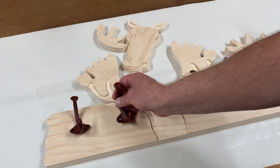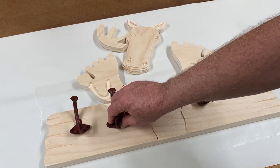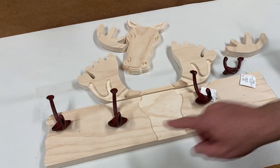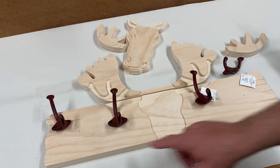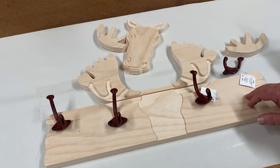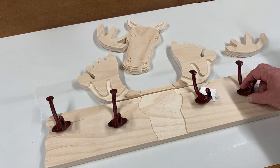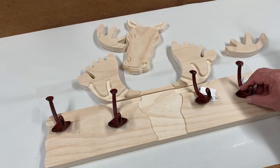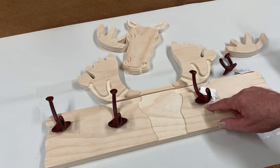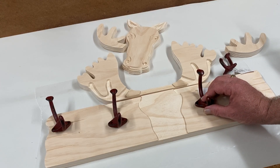The test fit went okay, so I'm getting ready to figure out where I'm going to put these hangers that I picked out at one of the Arts and Crafts hobby stores. I've got a couple of divots that are part of the project on 16-inch centers, so if you're going to hang this aligned with a couple of studs in the wall, you've got the 16-inch centers here. I'm going to go ahead and drill countersunk holes at each of those points, then mount the bracket on the 16-inch centers right over that screw so it's not visible. Then I'll mark from the center of each divot over three and seven-eighths — that's the spacing I figured would be good for these hangers.